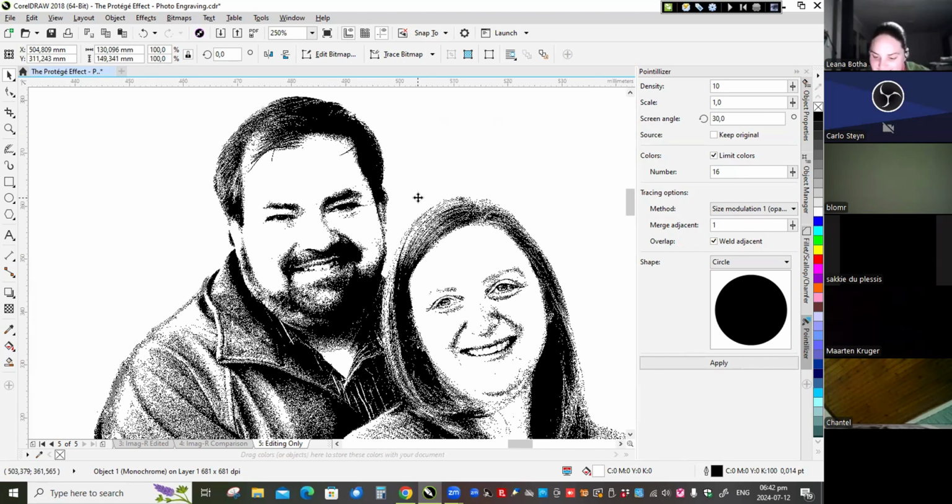Just now I was talking to somebody about the same topic. We're talking on WhatsApp, and they were asking, like, what do I use? And I was saying, well, Corel. And then we're talking exactly about what you're showing here. And what I always say to people is, think like an old dot matrix printer. She said, well, okay, printer. I said, yes, think like that printer. It's just got one color and it's just got to hit dots. And that's what the laser sees. The laser's got one laser beam. So it's got to use dots and clever things to give you the shading and the effects.